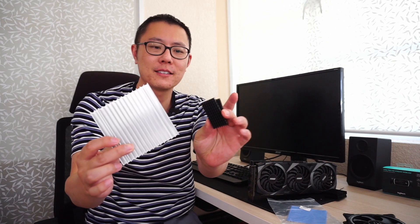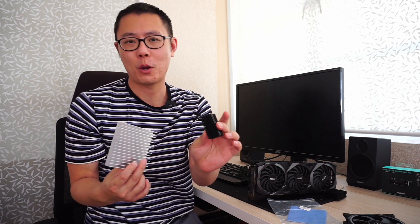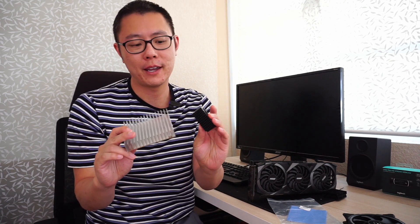I've actually got two types of heat sinks here. In preliminary testing, it was the small one that actually turned out to be much better than the large one. That might be because of the material, or because it's got a little bit more fins squashed together, so maybe it has more surface area. Looks like the small ones are actually better. In the results, I'll just have one set of heat sink results — I think it's going to be this small black one.